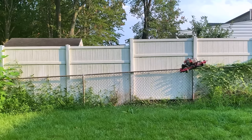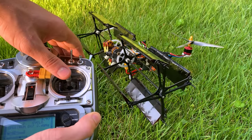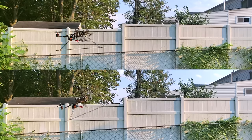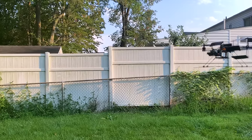A typical quadcopter needs to pitch its whole body forward in order to move forward. The cyclocopter can fly just fine like this too, but by fixing the pitch angle to be level in the flight controller and mapping the pitch stick input to the forward and backward cyclorotor thrust vector direction instead, the cyclocopter will actually translate forward and backward without needing to pitch forward or backward.